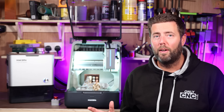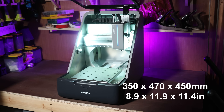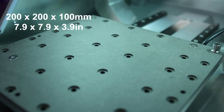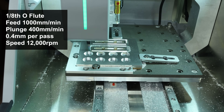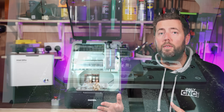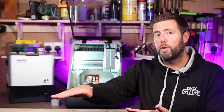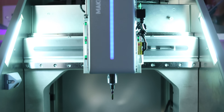For ease, I will quickly recap some of the highlight specifications. The overall size is about 350mm wide, 470mm deep, and about 450mm high. With the lid open, that goes to just over 800mm. The work area is 200 by 200mm with a Z clearance of 100mm. If you are looking to do longer pieces, the back on this machine is removable, so you can put longer pieces of material through and effectively do what is known as tiling — machine one part of the job, slide it along, and machine the second part. So whilst it technically only has a 200 by 200mm work area, you can do longer projects using the tiling method.